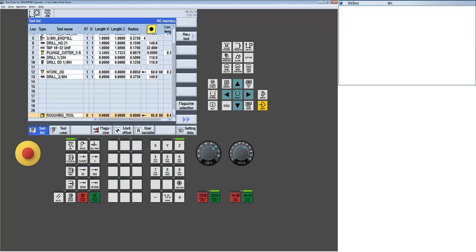One major difference from competitive controls is that tools do not have to be numbers — they can be named anything you want. I can build in user comments or notes right into the tool name. For example, I might name it VNMG 332 with insert IC, radius, OD tool, chip breaker info. We support quite a few characters in a given name — letters, numbers, special characters including forward slashes. This way you can easily identify the tool at a glance.